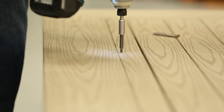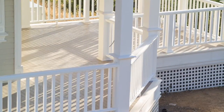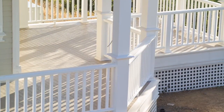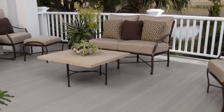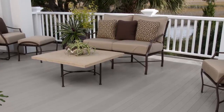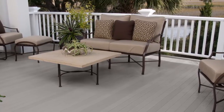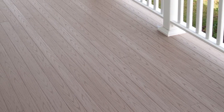There are many options for completing the look of your Azek porch. One option is to cover the exposed edge with Azek trim or Azek deck rim joist cover. Another option is to picture frame the entire porch using Azek deck as a border. If this option is chosen, you will need to lay out the porch accordingly to accommodate the variance in spacing and height. Or you could attach an Azek molding profile to the exposed edge.